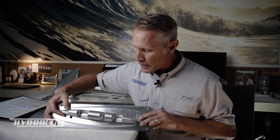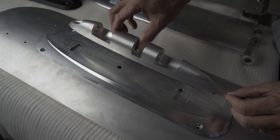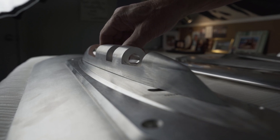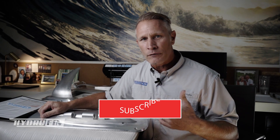If we want to increase the angle of attack, we can increase it and lock down those screws in the back. If we need to decrease the angle of attack according to that chart, we can do the same and lock those in. So for each installation and each boat, using this chart, we can know exactly how this product needs to be installed to generate the best results.